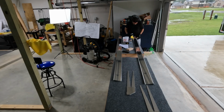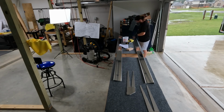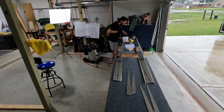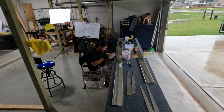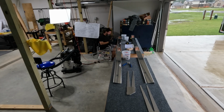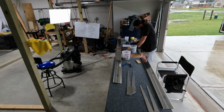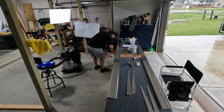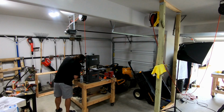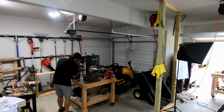And it is a fairly critical measurement because there are a ton of rivet holes. You can see from all those clecos there are a ton of holes there, including just outboard of that doubler where there's a rivet attach point. And so if you miss the mark by even 1/8 of an inch, you've probably blown your edge distance on one of those parts. And in addition to that, there's an odd-shaped hole that you have to cut out of the middle of those spars. You can see it on the spar right there. That's where the pass-through is for the aileron bell crank tube, something like that. So I'm futzing around with the drill press to try to figure out how to cut these holes cleanly.